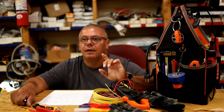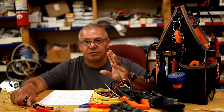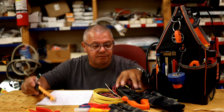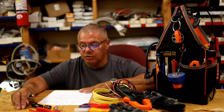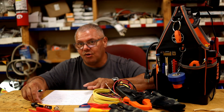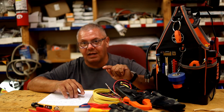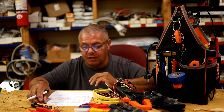There is a proper way to remove an outlet. You remove the hot wire first so the device is no longer live. That way, if someone told you the power was off and it isn't, you're safer. When you reconnect, reverse the order: ground first, then neutral, then finally the hot wire. This way nothing is live until that last hot connection is made — you might see a tiny spark, but there's no load on it.